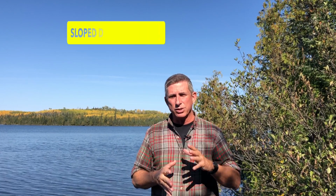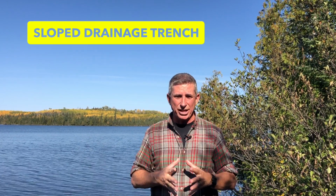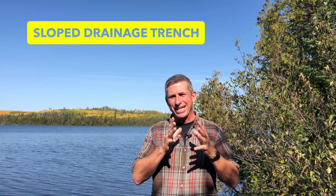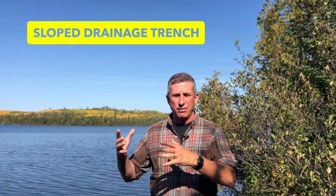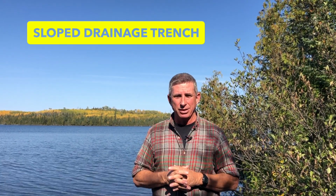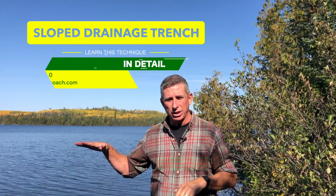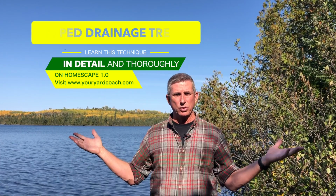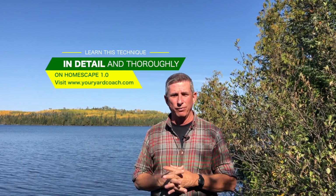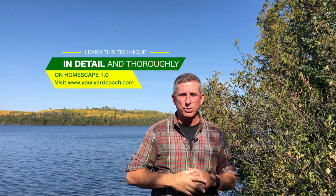Another key component is learning how to put in a properly sloped drainage trench so that you have at least a 1% fall for the water that comes off your house, from your catch basins and to your basin. So you start out at the origin being a little shallow and you finish a little deep, and you should have at least a 1 to 2% pitch so water makes its way where it's supposed to go. If you start making it level, or you start making it like a roller coaster, it just will not perform like you want it to.